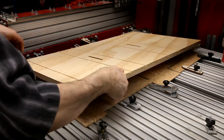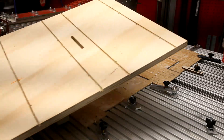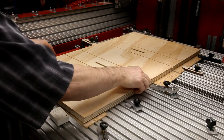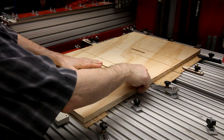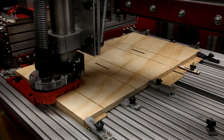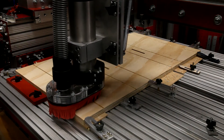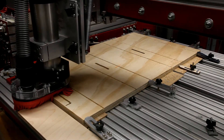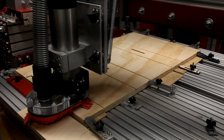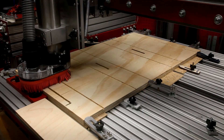To mill the remaining features I flip the stock over, and in this case it's now oriented in its actual position. I then begin to mill the remaining features — in this case I'm milling the slit for the low frame spacer, then the large entry hole, and finally the pilot holes for the frame spacers. And that completes the front panel.